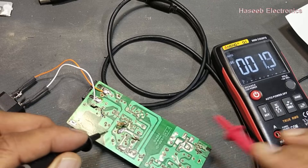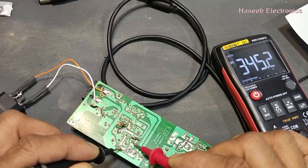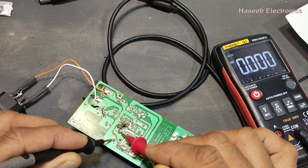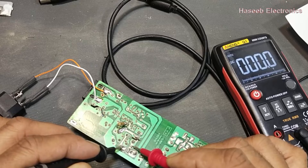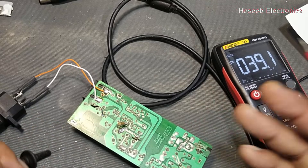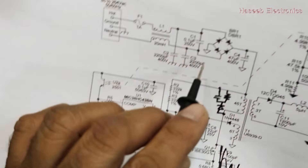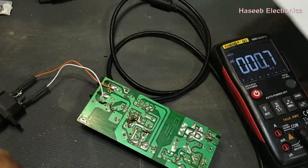Using any DC multimeter you can verify that there is switching: when the voltage level from drain to source increases compared to the capacitor — here the capacitor is 311 volts and the MOSFET reads 340-348 volts — there will be approximately 20 to 25 volts difference between these two. If this difference is present, that means the IC is switching.